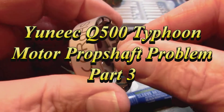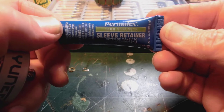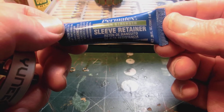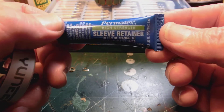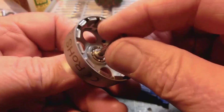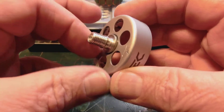This is locked in place right now. I used the green locking compound — it's called sleeve retainer, designed to retain sleeves on crankshafts and also used to retain gears on motor shafts. That's pretty good stuff. This thing had quite a gap in it, but I put some of that compound in there, spun it around to work it in real well, and then let it sit overnight.